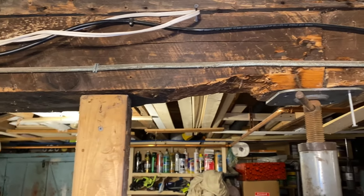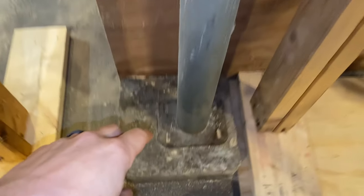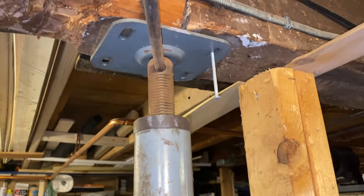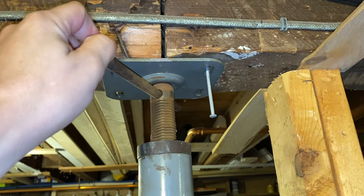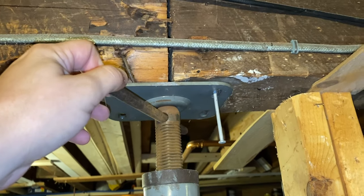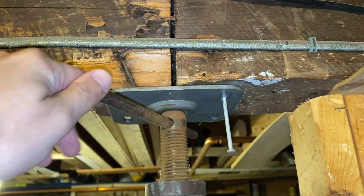We're supported on that side, supported on that side. Before I start cranking this up, I'm going to take a measurement right here down to here. There's a footing, so that's good — that's what you should have. I don't know how thick it is, but it's been here for a long time. Do I think that these being temporary will fail? Not really. These posts are really meant for if you have a large piece of furniture, or say you're putting a hot tub in the middle of a room — they're made to help support a load like that along with the main supports. They're really not meant to be the main supports for your floor.